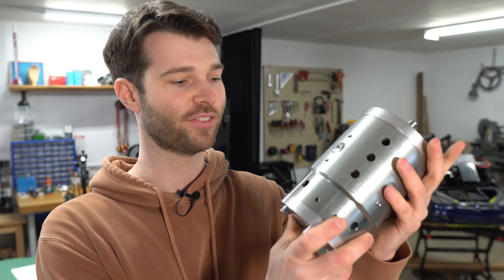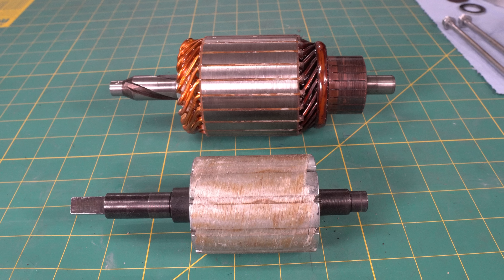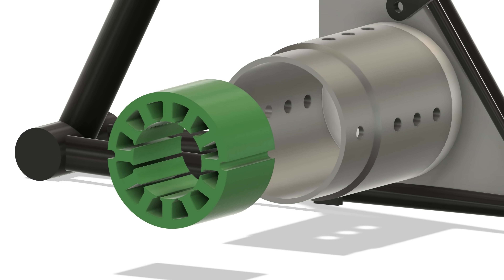Before I move on, I should probably talk about my plans for this motor. The inside diameter of the starter motor is almost the same as the inside diameter of the brushless DC motor. Additionally, the rotor of the brushless DC motor is 65mm in length and the armature of the starter motor is also 65mm in length. Because this is my first time building an electric motor and I am no expert in motor design, I figured I would try to replicate the design of the brushless DC motor, keeping the stator design fairly similar.